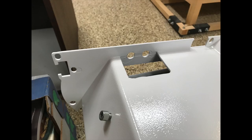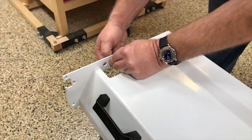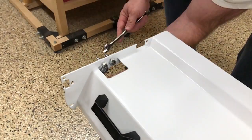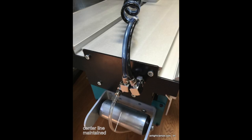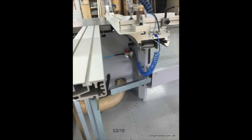If I had used the channel to the left of the one with the air lines in it, I probably could have avoided having to make the following modifications. As you can see, I ended up cutting out a portion of the plate to make room for the quick disconnects on the end plate, just like on the other side of the slider. Here are a few shots of airtight clamps installed on other saws which did not require the modifications that I did. And like I said, if I had thought it through beforehand, I could have done it differently and saved myself the extra work. However, once I had drilled the holes in the end plate, I was committed.